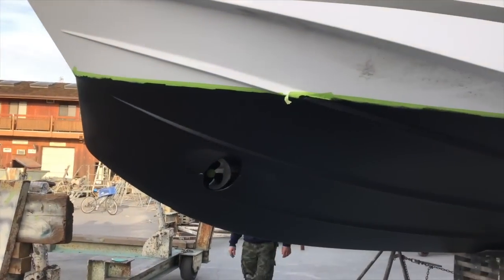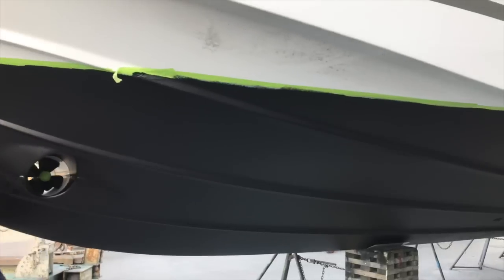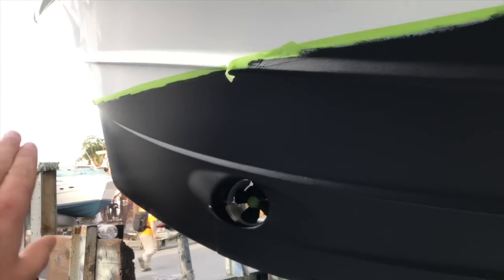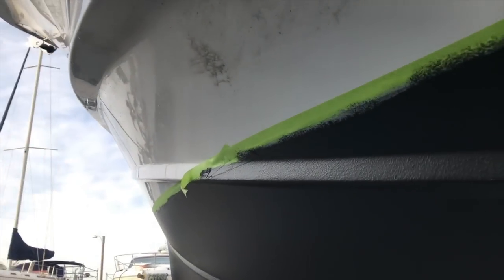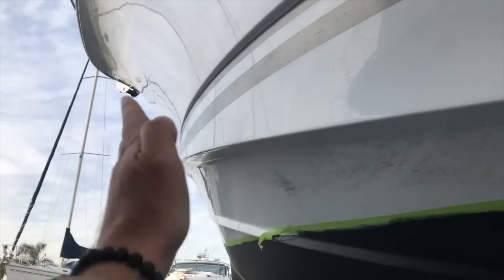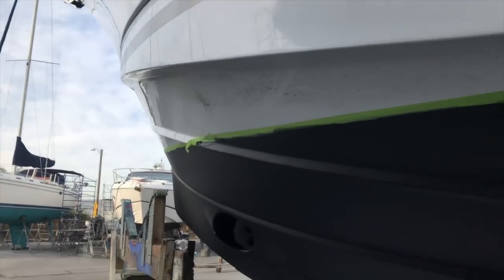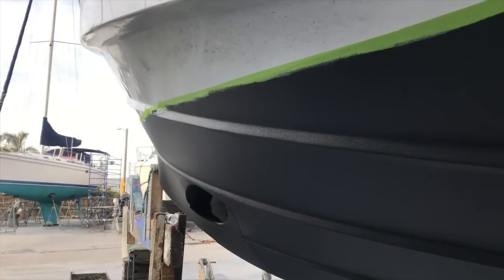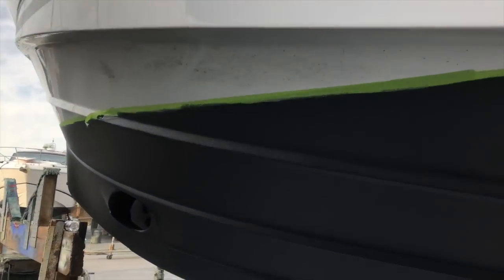You're also going to notice that we have three hard chines on the bottom side of the vessel carrying aft. When you look at the angle and you look at the break line chines here, the vessel is a very dry boat. It has a lot of shear to that. What you're looking at is the dynamics of it going through the water but also the spray itself being diverted down, creating a very dry ride.